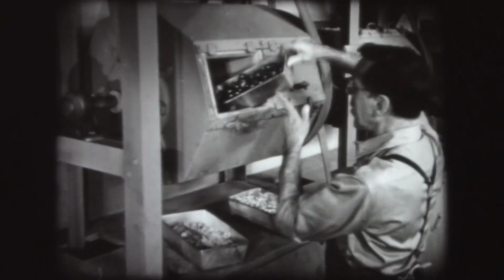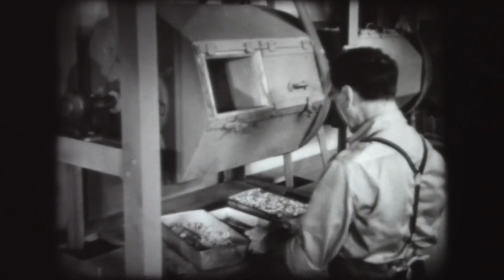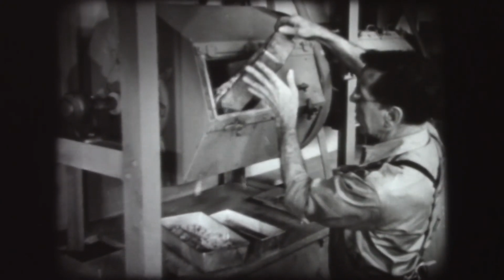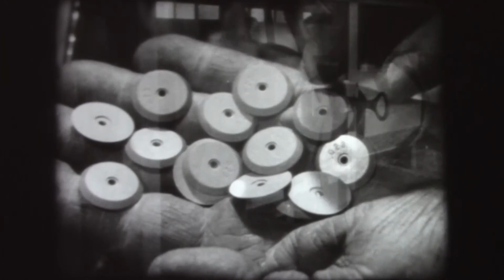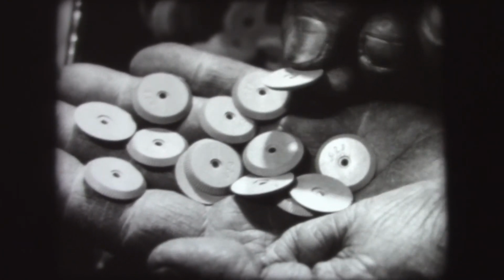For polishing, usually smooth wooden and plastic balls are placed into the tumbling barrel with the plastic pieces. Polished or waxed wooden pegs are also added. The barrel is then rotated as before. They are now finished to a high luster and ready for use.